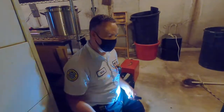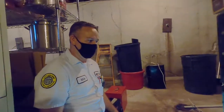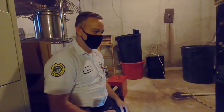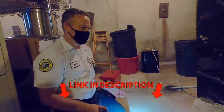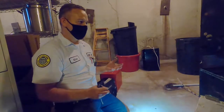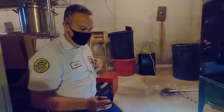We wear detectors to make sure we don't have any carbon monoxide in the home. Carbon monoxide is rated in PPM — parts per million. Anything over nine parts per million and they want you calling 9-1-1. That's why they recommend having a low-level carbon monoxide detector in every home. Any gas-burning appliance can create carbon monoxide — it's a byproduct of those burners and gas lighting.